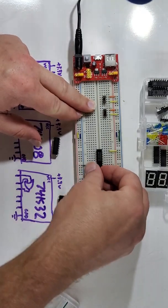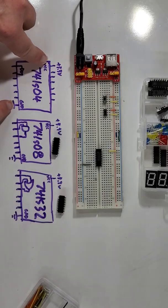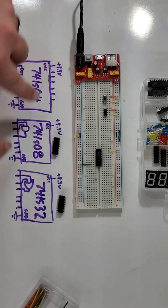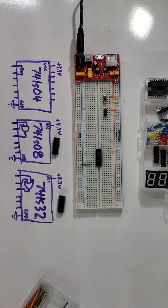You're going to make sure that you double check these data sheets, because on here, power and ground, VCC and ground, VCC is another way to say power, these are always in the same place on these chips. But in some of the extra chips we use later in the year, that's not going to be the case.